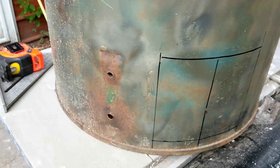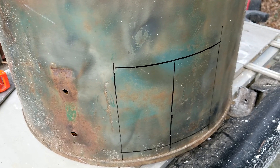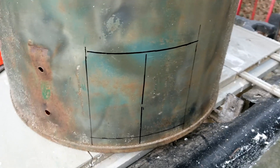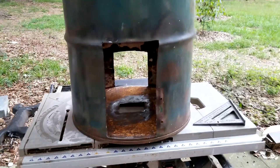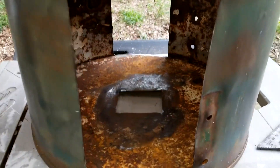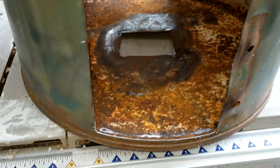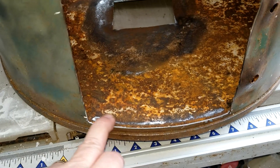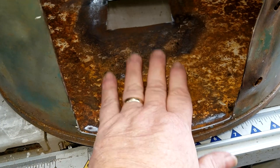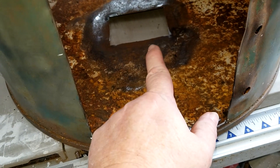If you're wondering about the holes, we'll cover them with metal insulation tape from the inside before I throw in the insulating concrete. We got our barrel cut out. I sanded that down around there and I'm just going to put metal duct tape over it. On the bottom here, I went and sanded this down flush so that the burner sits flush on the bottom. But I'm still going to tape that hole just in case — I did that on both sides.